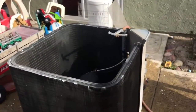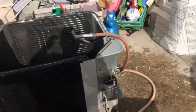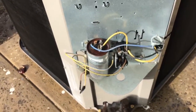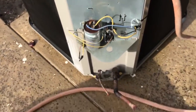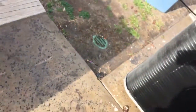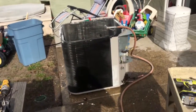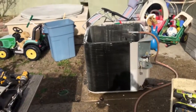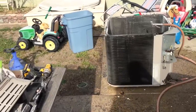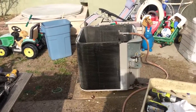The serial number on this one is 06, so I'm guessing it's around 2006. Gonna put a new capacitor and new contactor in it too. Cleaning up the coil — just using water on the coil because they've got animals here, so no coil cleaner on this one. If anybody knows who makes this unit, let me know in the comments. Like and subscribe. Thanks.